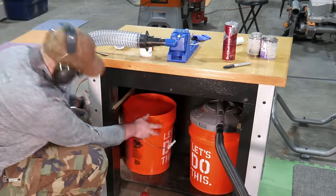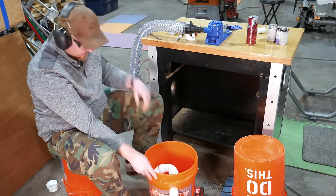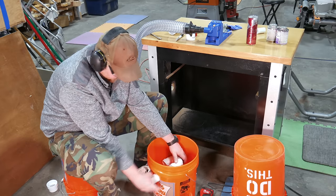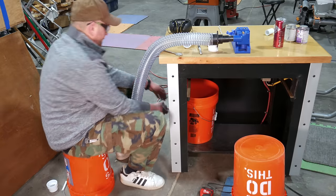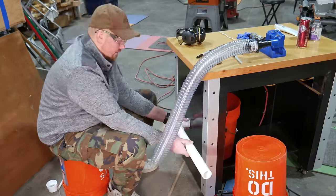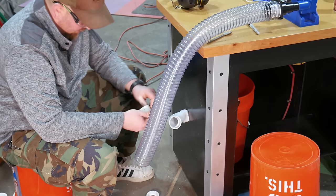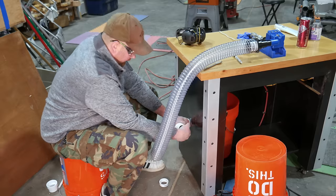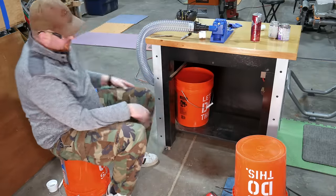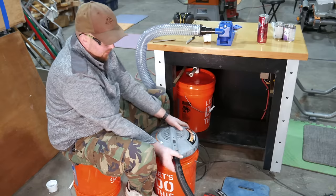Next we'll need to cut the dust hose pipe to size. The length really depends on your particular setup and whether you're installing this in a cabinet. If you are, just keep in mind that you will need to be able to remove the bucket to empty the dust. All I really need here is just a couple inches of the PVC pipe to protrude out of the cabinet, just enough to attach a fitting. After the pipe is cut, dry fit a 90 degree elbow on the end of the dust hose pipe. Then cut another short piece of PVC pipe and dry fit that to the other end of the elbow. And finally, the last piece of the PVC puzzle: a 2 inch by 1.5 inch PVC flush bushing. The outside diameter of this bushing fits the clear dust collection hose almost perfectly and is the key to making this whole system work. Keep in mind you may have to modify the types and sizes of pipes and fittings depending on what size vacuum hoses you'll be attaching the dust collector to. As long as the general design and layout is the same, you'll be fine.